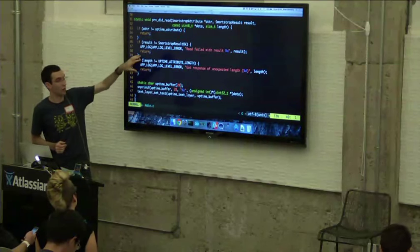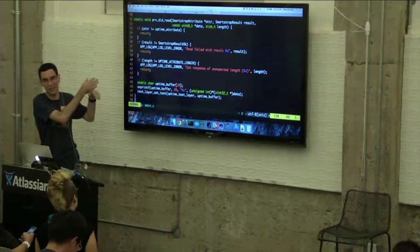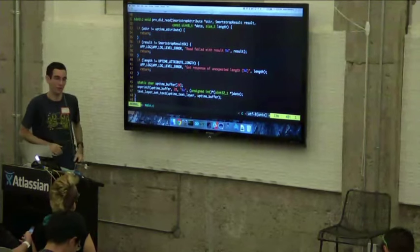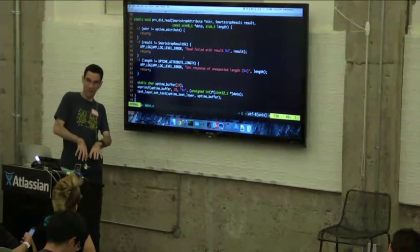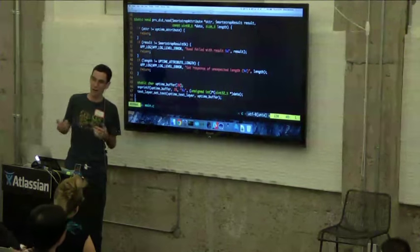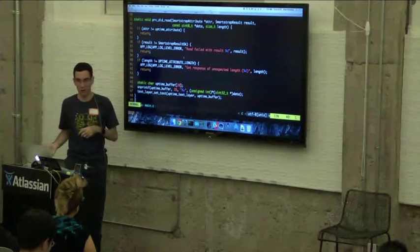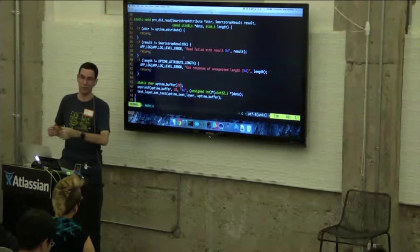Again, this callback is passed in the data that we got, and you shouldn't be using this data outside of this function. It's only valid within the scope of this function call. So that's how we make this simple demo that shows you how to do reads of the Smartstrap from the watch, shows you how to do notifications from the Smartstrap to the watch, and make write requests from the watch to the Smartstrap.